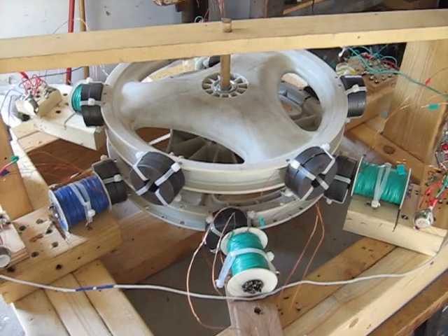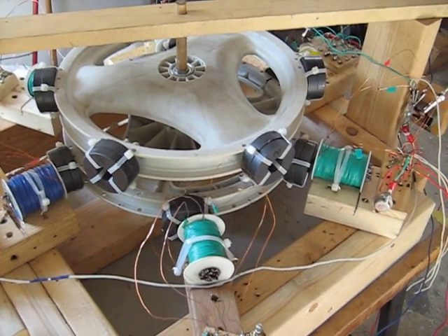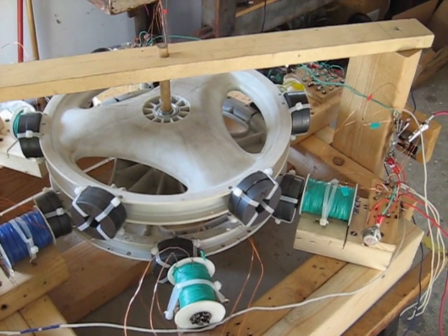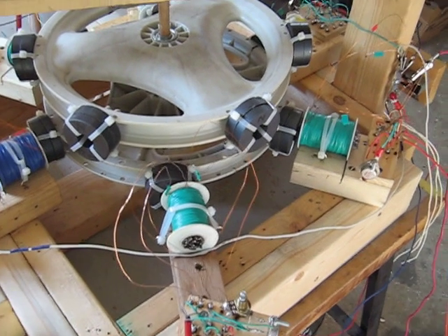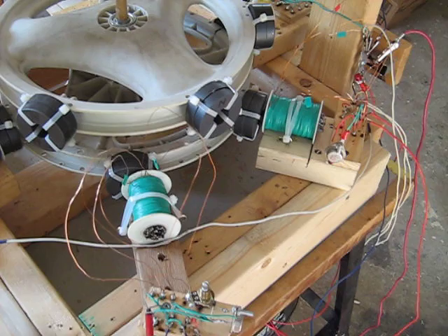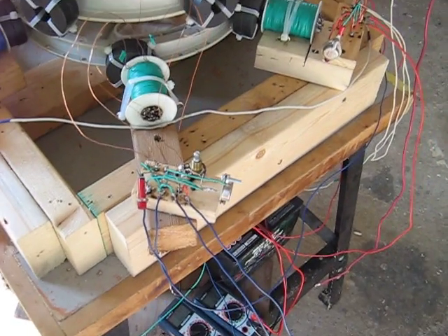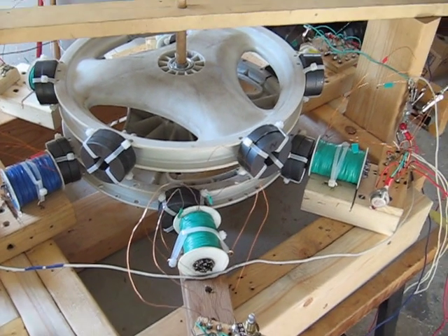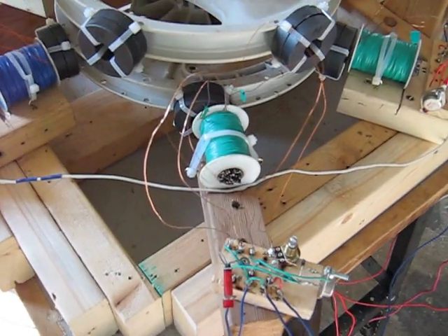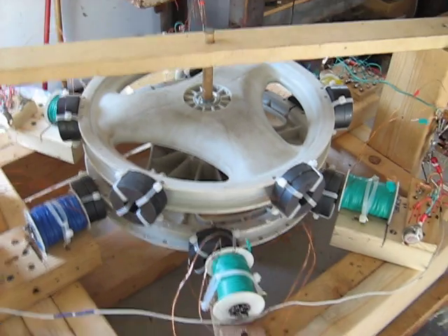Something I'd like to point out: I haven't watched Bedini videos in quite a while, but in the last few days I had a real good dose. A lot of people build these things and tune these coils to their sweet spot — the spot where the run wire is using the least amount of amp draw. But it's been my experience that most people assume that when they turn these circuits up and the amp draw goes up, the wheel becomes less efficient. I don't really think that's the case.